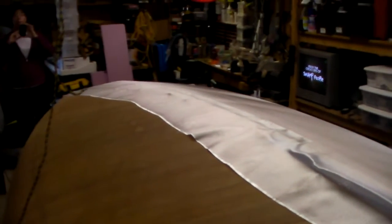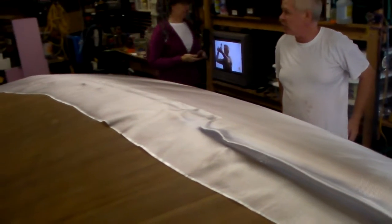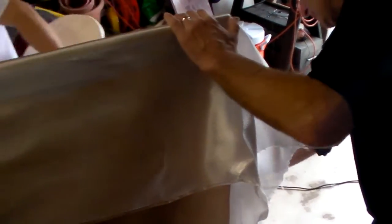The first thing we're going to glass is the inside of the centerboard trunk. I sanded down only about an inch, so we're going to have to cut out that chunk. Do we have enough overlap here in the front? Plenty. The top is going to be covered with a plate, so I was actually considering not even glassing this because we have a rough edge here — but if it'll go cleanly, that'll be fine.